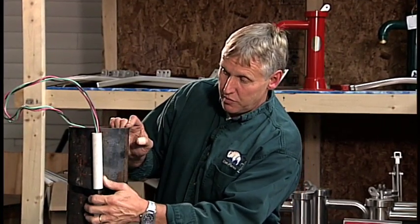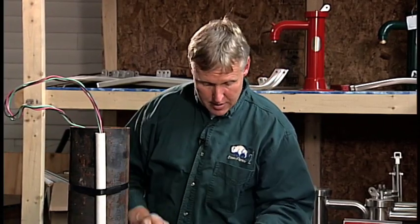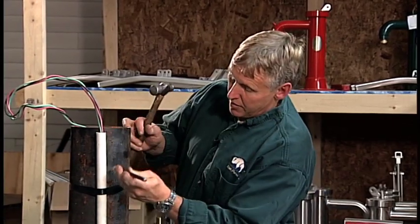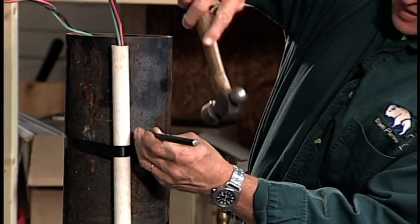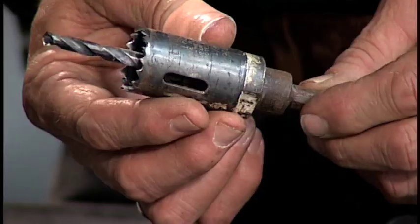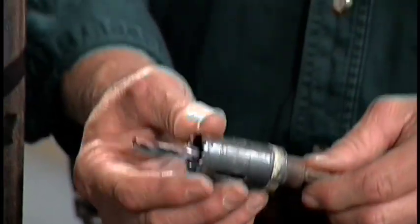You can just push your conduit off to one side — there's lots of slack in that. We're going to take a center punch and a hammer. You've measured down 4 to 6 inches, just pick a spot, and you're going to center punch the hole. After we've marked the center punch in the casing, we're going to take the hole saw.